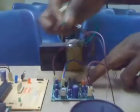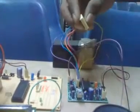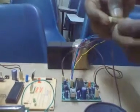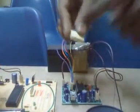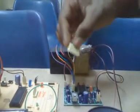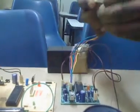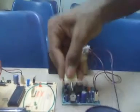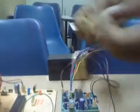I will remove the recording jumper and start playing back what I have recorded. 'One.' This is two — I am just connecting it to ground. Each of the slots has a stored voice; connecting it to ground plays back the voice stored in that slot. 'Three.' This one is the fourth one: 'Four.' These are the voices I just recorded.